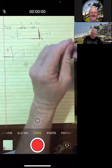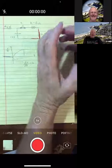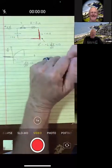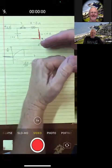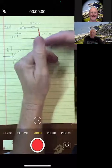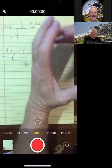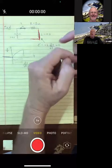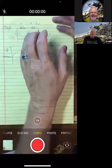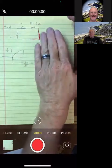It's exactly the same idea we said with capacitors, although with capacitors, we said after a long time, they fill up and block the current. And so the current would be zero in that branch where the capacitor is. Whether the capacitor blocks the whole circuit or just a sub-branch of it, it blocks it. And so after a long time, we said capacitors are treated as an open circuit. Inductors are exactly the reverse.